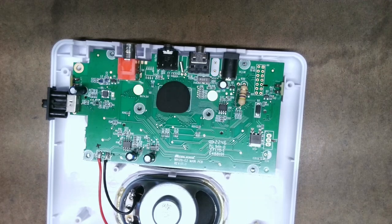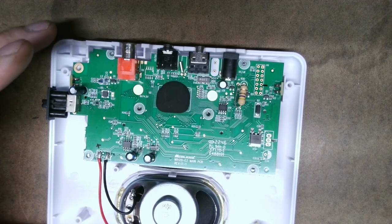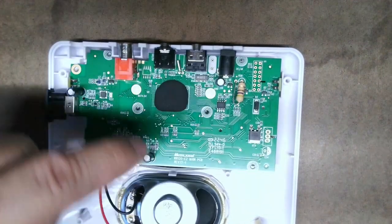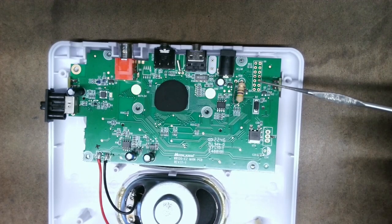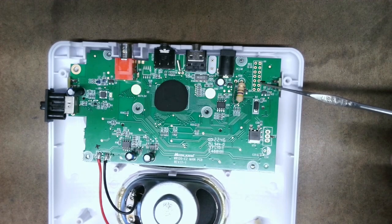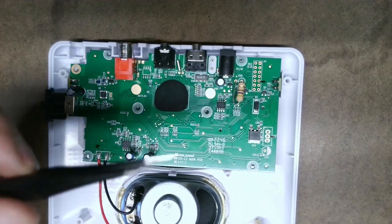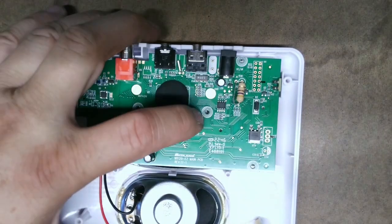That's all you need to take off. The terminals we're going to use to access that switch — I took a picture of this board and I'll post a link to it in the description with arrows pointing to these spots so you can see them clearly. I marked them with a black marker for this video. There's one here and one here. The middle one is ground and the top one is the switch. I verified this by touching it with metal tweezers — touch it once and it turns the radio on, touch it again and it turns it off, just like pressing the button on the front.